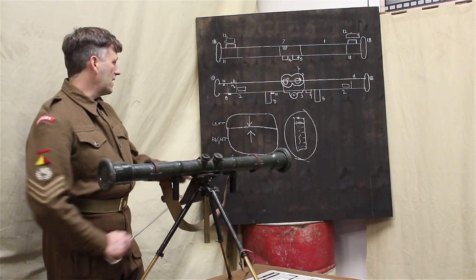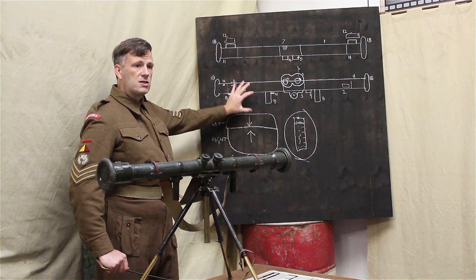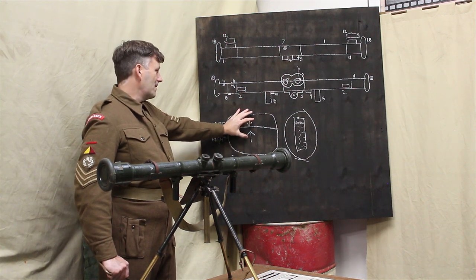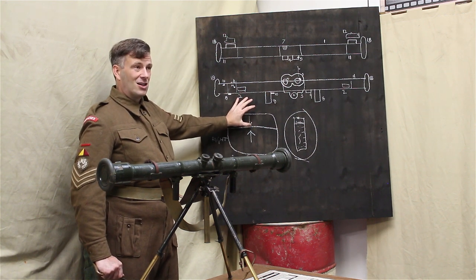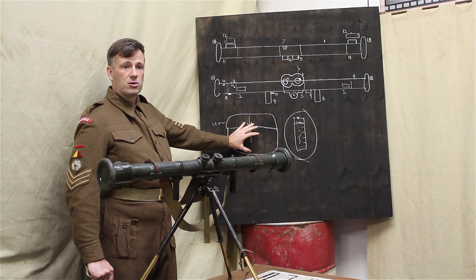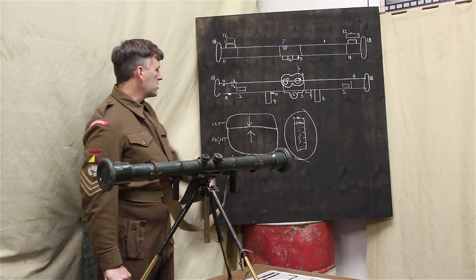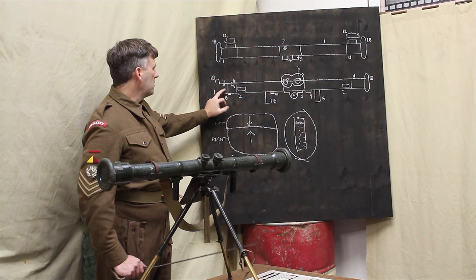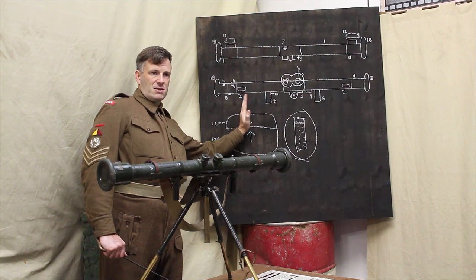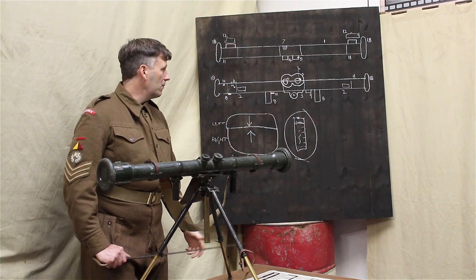It moves that left-hand prism, so it moves this top image up and down so that you can make it, certainly on skylines, see the same area as the bottom does. It'll be much more obvious when we do actually start to look through these. So that's your halving adjusting head, and the coincidence adjusting head rotates the prism a little bit to enable you to straighten those up as well.